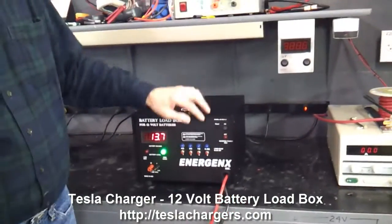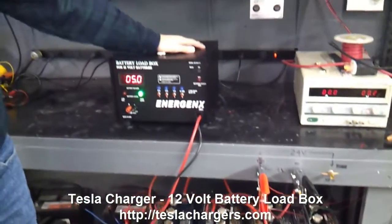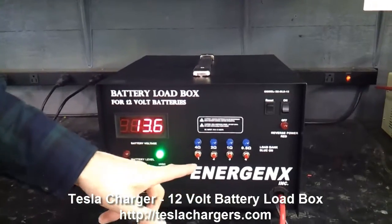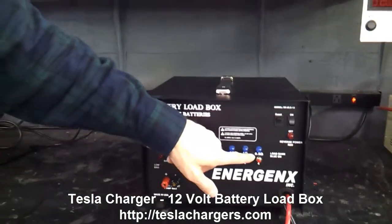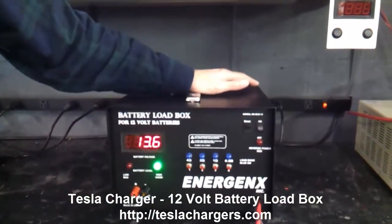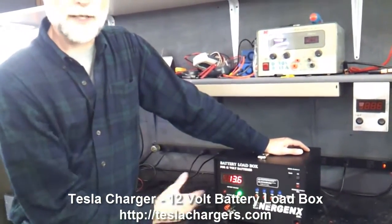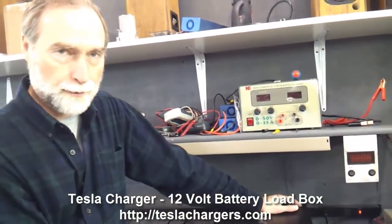The unit — I could turn it off and the whole thing is just inert. As soon as I turn it on, it goes into this mode. It has four buttons labeled 4 ohms, 2 ohms, 1 ohm, and half an ohm, and each one has an indicator light. On a 12-volt system — and this is only to be put on 12-volt batteries — a 4-ohm load draws about 3 amps, as you would figure out through Ohm's Law.